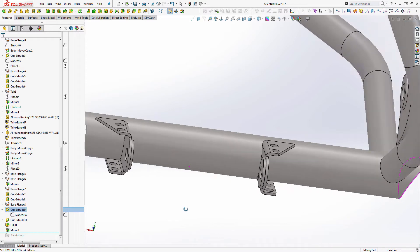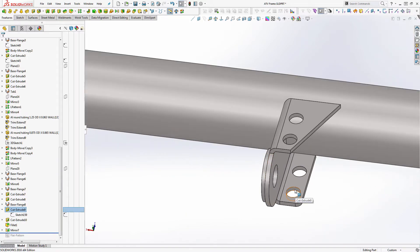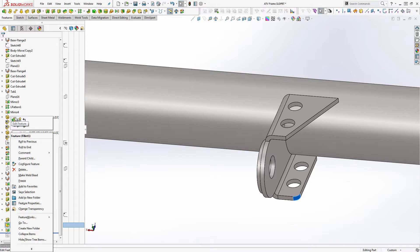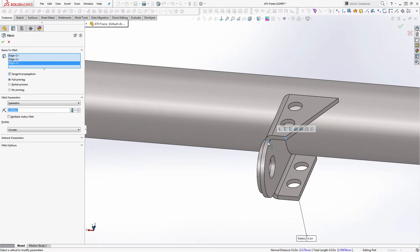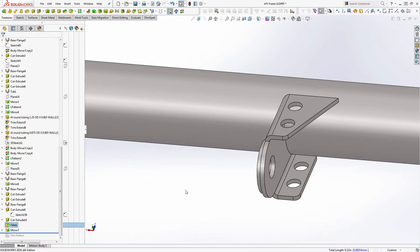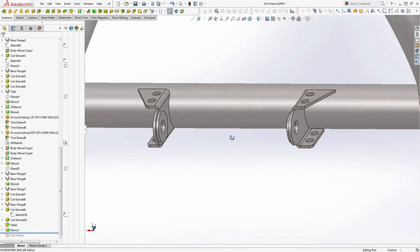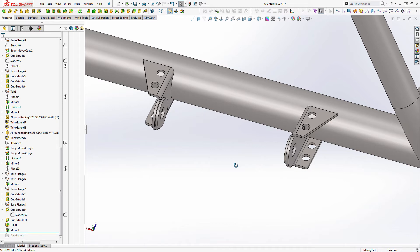Now everything's flipped over. We've got our speed holes — our lightening holes — through both components like I wanted. They start from the bottom. I don't like how close that top hole is to the edge, so we'll go with 0.3 and 0.375. That looks pretty good. I'll fix that fillet real quick and get that edge too. So that's our bracket — I mirrored it over afterwards, so all the changes get picked up on that side. Guys, that's a hack — that's a way to flip the normal over when you're sketching on a face. It gives you the ability to flip your sketch over and move it to another surface. I hope this helps someone — talk to you later.